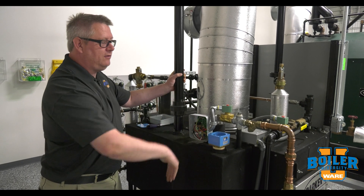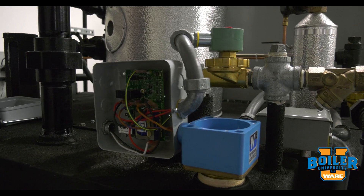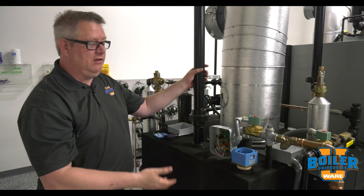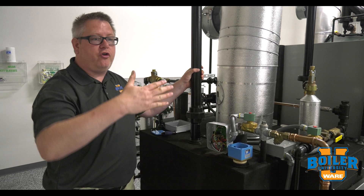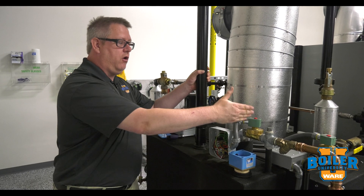This is quite simple and not hard to troubleshoot. The advantages are that all of the connections are through the top of the tank, so we don't have flange deterioration, and it's easy to retrofit. The downside is that it is on/off — where a trough valve will modulate the flow into the tank, this is all or nothing.